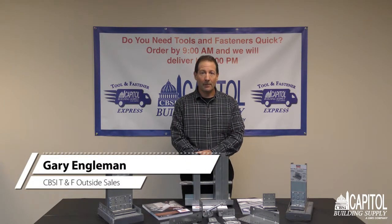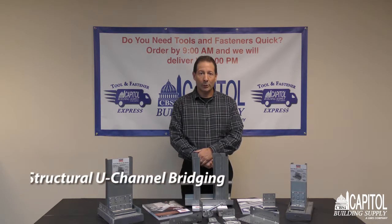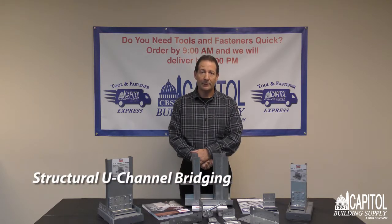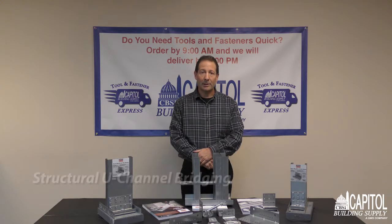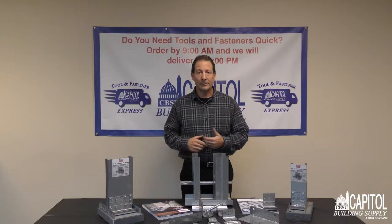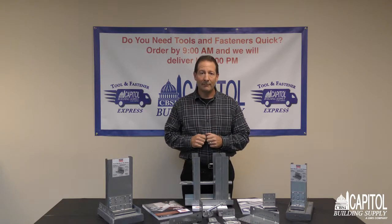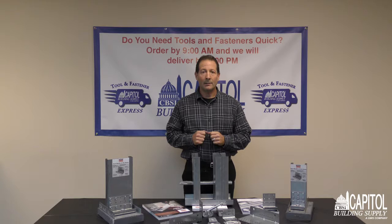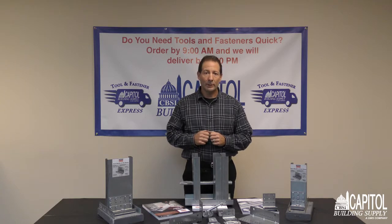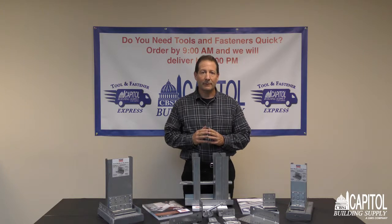Today we're going to talk about exterior bridging for commercial buildings that is conducted by drywall contractors, interior finishing contractors. For the curtain wall, the exterior facade of the building, we need to have this done prescriptively due to code requirements to prevent torsion from wind load and crushing that happens from the facade.